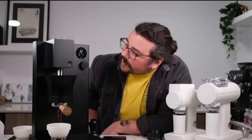At 30 seconds, we ramped up to 8 bar, and now within 5 seconds, we're down to 6 bar, as I told it to. 5 more seconds, we're going to go down to 4 bar. Yep, we're now at 4.4, 4.3, 4.0, and now I told it to cut off after that. There we go. So it listens to the app a lot better than before. There was that bug, right? No, after we reset it, it was just fine.